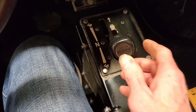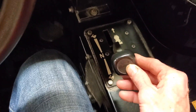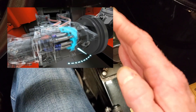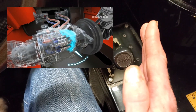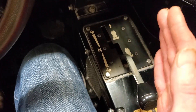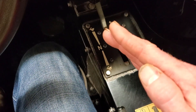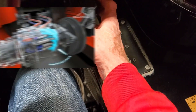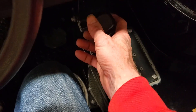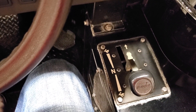When you move this lever, you're changing the swash plate angle, and that angle determines how much fluid is moving. Moving the lever forward changes the swash plate angle one way; moving it to neutral or back changes it another way, with pistons connected to the swash plate. Max setting equals max swash plate angle, which equals max fluid movement. Decreasing the angle decreases fluid movement, reducing power. Moving this lever back towards neutral reduces transmission power, slowing the machine down — and that's how a hydrostatic transmission can act as a braking system.